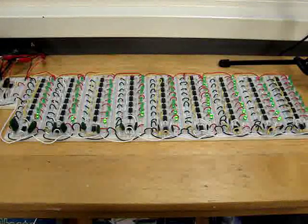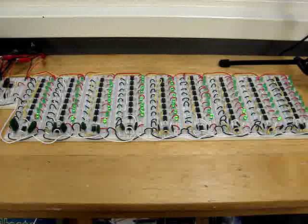For this year's class project for my second year students, I decided to concentrate on an interesting application for the 741 op-amp. It's the graphical portion of a graphic equalizer where it shows frequency output. Right now it's looking at a test signal from a sweep frequency generator. Each section was built by one student and each section is a stack of eight 741 op-amps configured as comparators, and at the bottom of each section is an active band-pass filter.